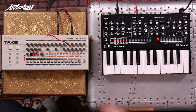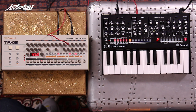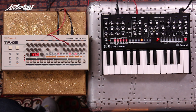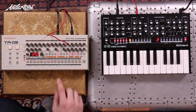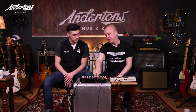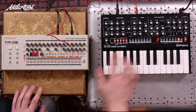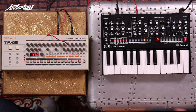So we'll start the sequencer, which means it's going to start receiving trigger signals. So now you can hear. You can program it from that side. Yeah, on the 1 and 4. And sometimes it doesn't play, and that's because this one has a pause note in that sequence. But if it's like this and it's clear, it will just follow this. That's really cool. You can even see where you are in the sequence right here. So if you have, let's say, 5 steps here and 16 steps here, no bar sounds the same because it kind of goes out of phase in a way.